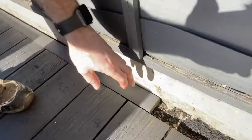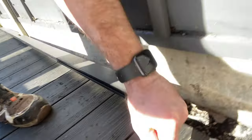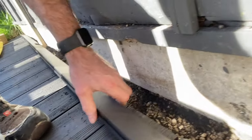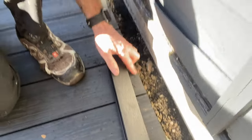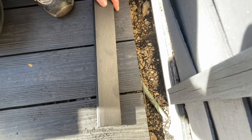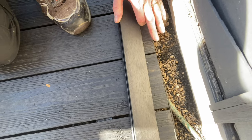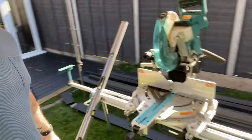I'm going to pull it back out. Now I'm going to chop some of the old bits of decking so I'll have a bit that disappears underneath here — about that sort of deep. I'll screw that in, and essentially that sits on top at a perfect level to marry up with the other one. I'll go cut a few pieces and show you. Just sorting up the saw.